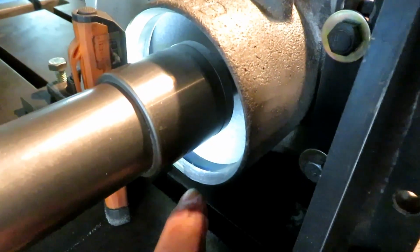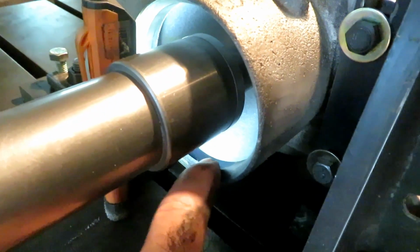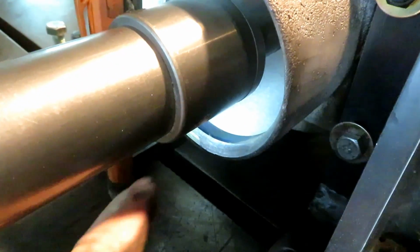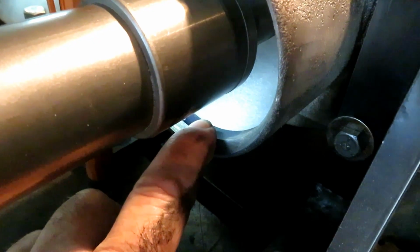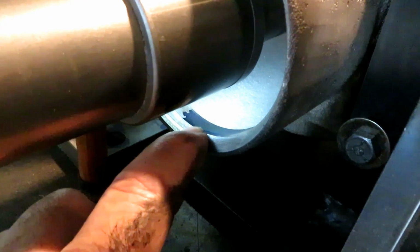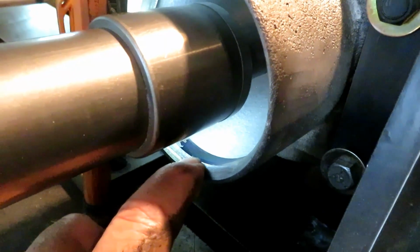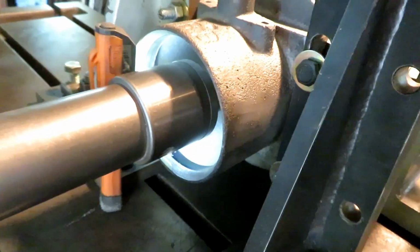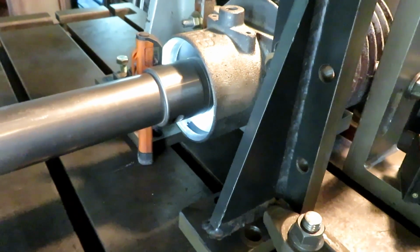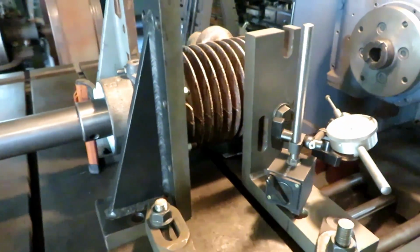Within about 6/1000ths, and then took a very light cut on a slower feed, kept the speed the same, and stopped here at the shoulder. This measures 10 1/8 inch down from the deck of the cylinder, because the sleeve is 10 1/4. That's a little more than I like to leave there, but that's the longest sleeve I could find. So that'll work fine. It's on dimension now of the sleeve, less about 1.5 thousandths interference for a press fit. So now we'll set it up and press it in.